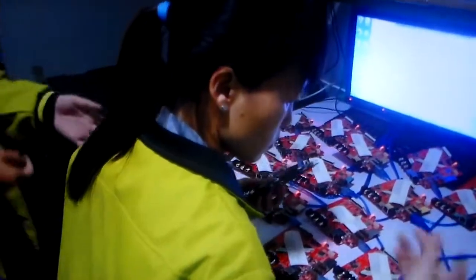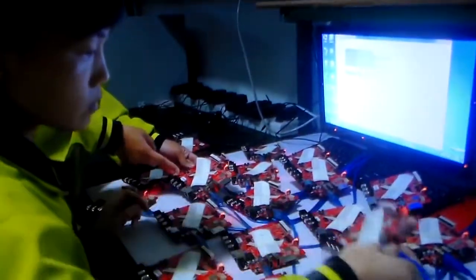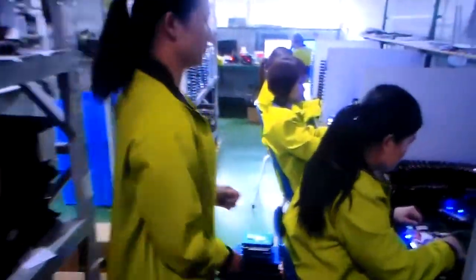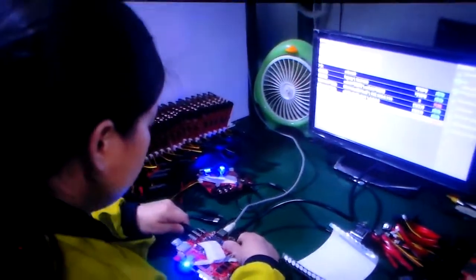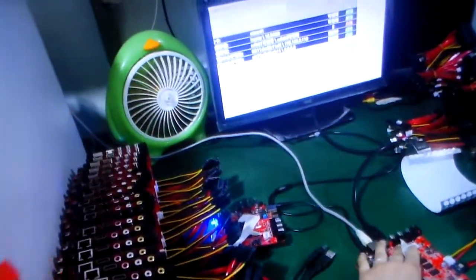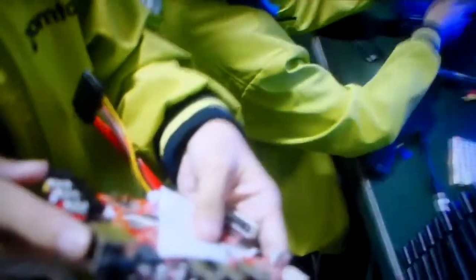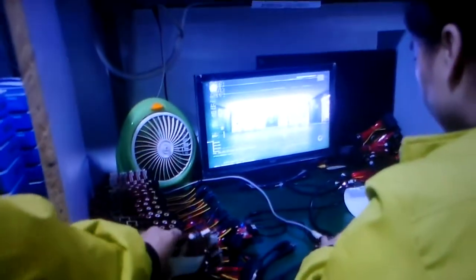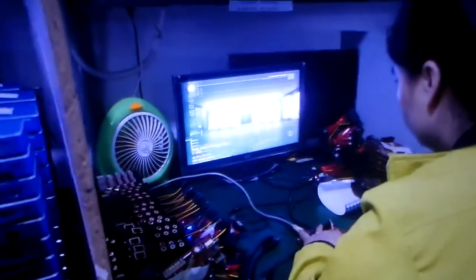Every box, we need to upgrade with the SD card. After a successful upgrade, it will show on the computer. We put the box through testing. This is our SATA hard disk testing. Every testing, we need to test the Wi-Fi, USB port, and the HDMI video and audio testing one by one. If there is any problem, we will take it to the repair department.